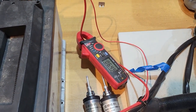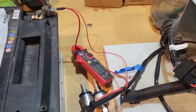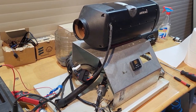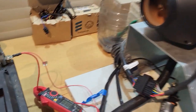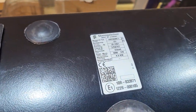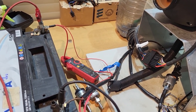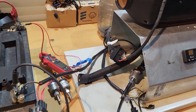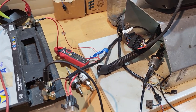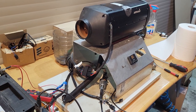It's running. We have a current consumption of 6 amps, almost 6 and a half. We can understand why these heaters are not really desired anymore and have to be changed — it's really big current consumption. About 7 amps, so it's 80 watts. The heater is 80 watts. The current consumption is correct. However, when starting it's almost triple — so really high current consumption on starting.